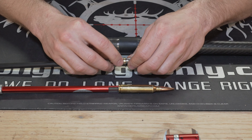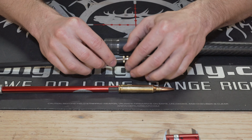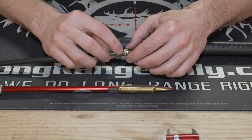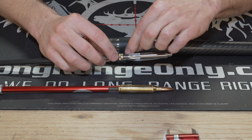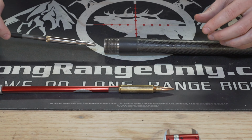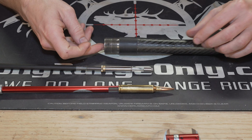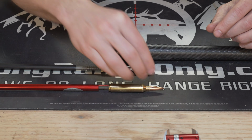Now I'm going to jump forward a few steps here. We went clear out to 250 thousandths before we actually started to get anything that we felt might be cutting. There was absolutely nothing going on for that time frame. So we go back in here, we repeat the process we just talked about. Clockwise direction, pull it back out, flush it really good, re-oil it, recheck it. At that point we had nothing really moving.